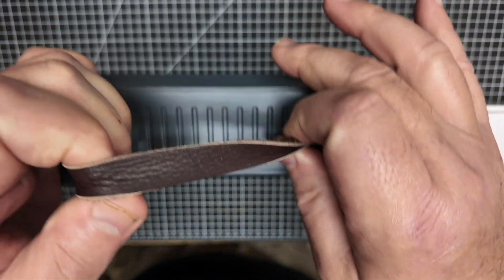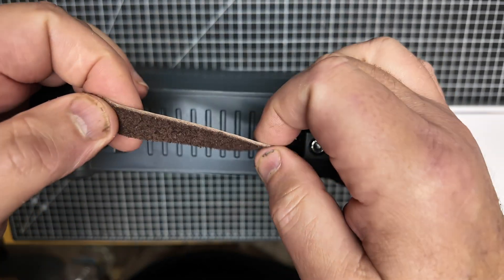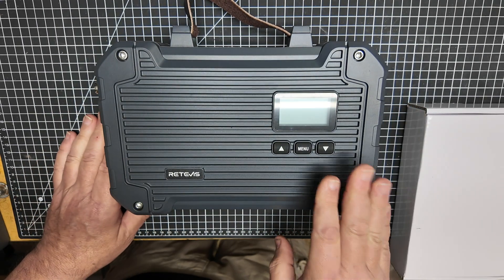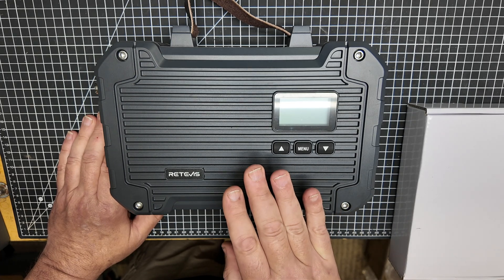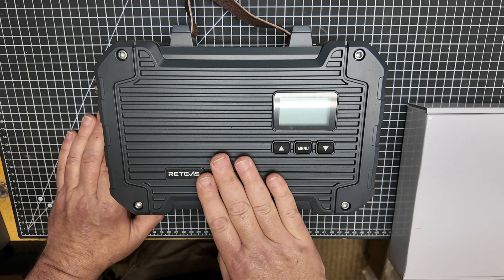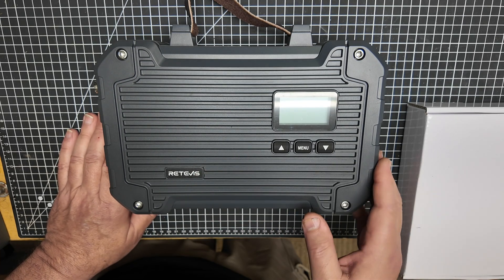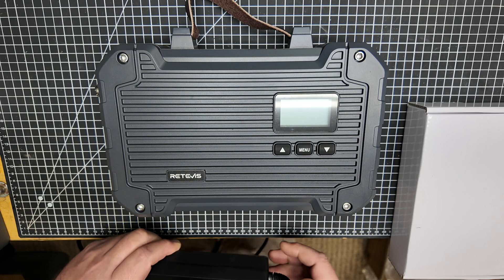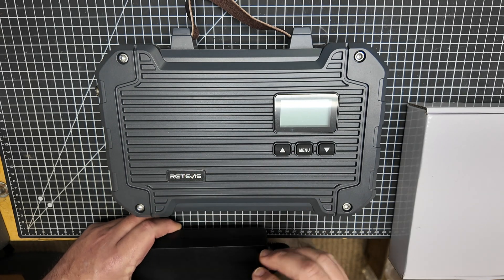It also comes with a nice leather handle. It's going to be very serviceable for a long period of time. Spec-wise, this unit claims to put out 25 watts. Sometimes when we have units that have a lot of internal components to act as a true repeater, we don't actually get that output out. But in my test, you're going to see we actually do get some very favorable results. The duplexer is usually where a lot of that energy goes, and the duplexer on this is a no-joke, self-contained unit. It's all really good spec gear.